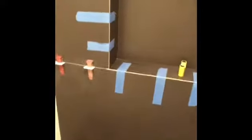First of all, you want to make sure that you've got a pitch, so water doesn't sit in that back corner. We don't want it to sit. It can. This is fully waterproofed, but we just don't want it to. The other thing too is you want to make sure these corners are square, so we use a square to get those, and then the top as well. And again, as you can see, all the miters are pretty tight. You don't want a lot of space or gap in between. And then again, same thing with the bench.